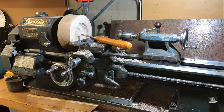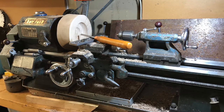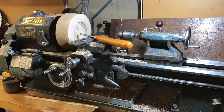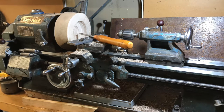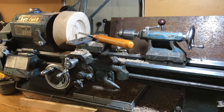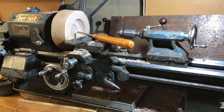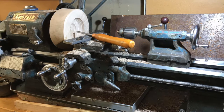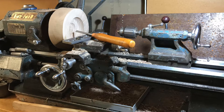Here I've got the lathe set up for woodturning. Woodturning makes an awful mess throwing stuff everywhere, but it's good for certain jobs and quite fun. This is a piece of elm I've been cutting for a specific job. You can see the chisel sitting on a tool rest, which is just a bar of five millimeter steel with various holes drilled in it for flexibility and location. It screws into a piece of metal that goes inside the T-slot in the cross slide. I spin this at 600 or 1300 rpm and shape the wood as needed. The chuck itself screws on with an eight thread per inch Whitworth thread, so you can unscrew it and attach a plain metal plate designed for turning between centers, but with holes drilled so you can screw it onto the back of a piece of wood.